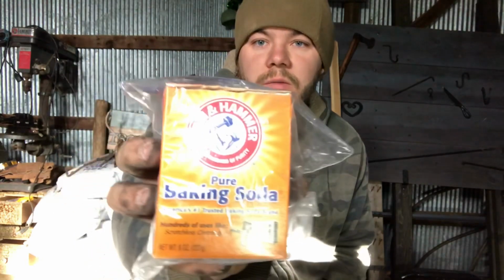Okay, the next recipe is crushed charcoal with baking soda, sodium bicarbonate. Now, this is basically the same as the Tums. We are just switching our carbon source from sucrose to charcoal, and our aid from calcium carbonate to sodium bicarbonate. Now, this mixture should not expand. The only expansion that should take place inside the container, and this is true for all these methods, is the gases inside the container when they expand due to heat.